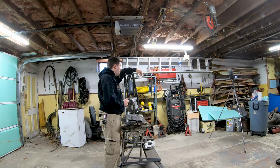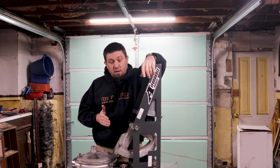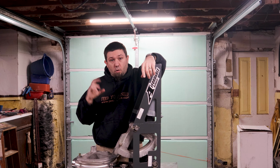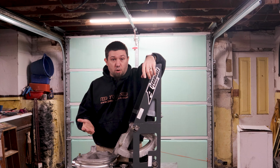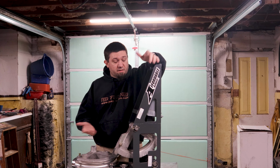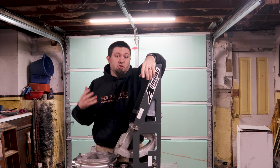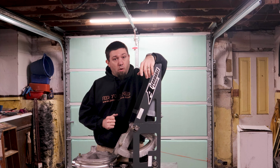However, most people build roll cages out of .120 wall. That's up to you. You can obviously go with smaller or larger tube diameters to get that strength. So if you did 1¾-inch tube at a less than .120 wall, still a lot of strength there. You can also build geometry into your cage to help offset the thinner wall tube.